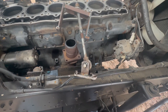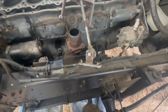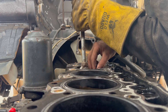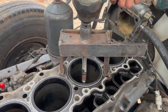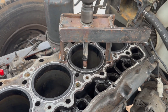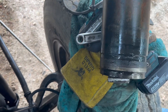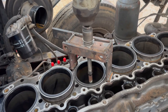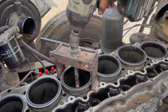Just spent about an hour making up a cylinder liner puller so I can pull the liners out — hopefully it works. Just used a few scraps and made a bit of a tower and some threaded rod, and then I made up a plate that fits in nicely under the liner to slide it down in the cylinder. Put a few more braces on the tool so it doesn't bend. That works beautifully.